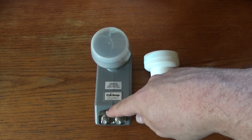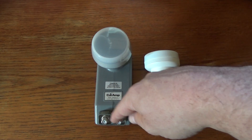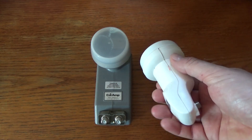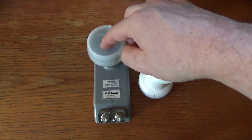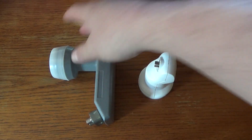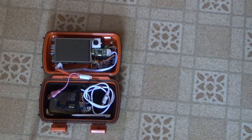They have a few other differences. This one has two inputs, so you can connect it to two different receivers, or have one as the power supply and one as the video out. This universal LNB is more suited for Europe and parts of the world where there are more free satellite TV signals, while the commercial one is more what you'd find in North America — your Dish Network, DirecTV, and so on. So let's get this all assembled and see what we can find.